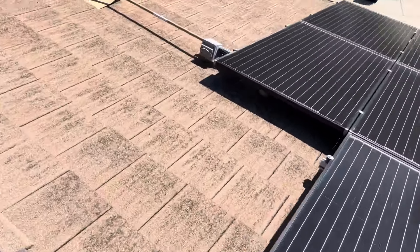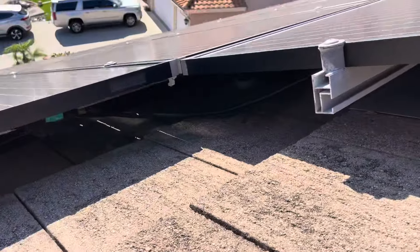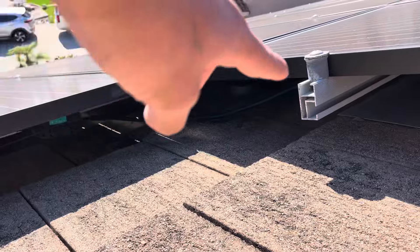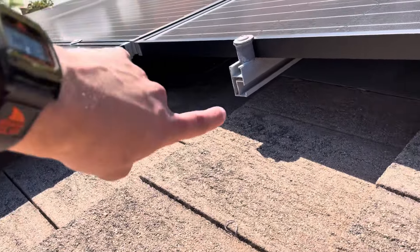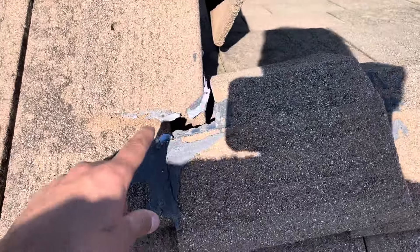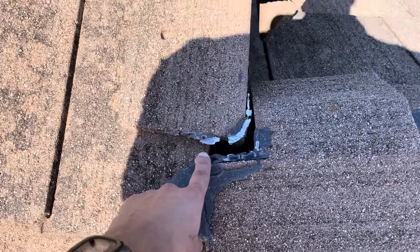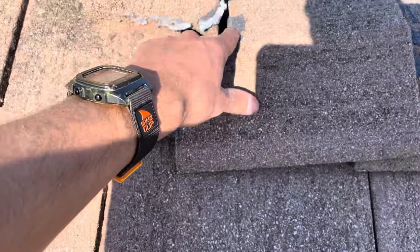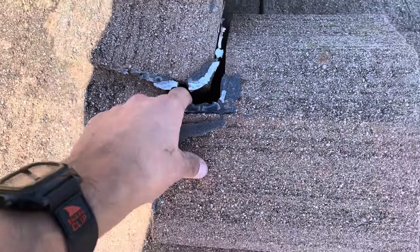However, I did notice a wire sticking out right there. We don't want to see wires sticking down — we could actually put that back up underneath. And then there's another exposed area to the rain: we see this cracked ridge cap. You can see mastic has been applied right here, but that rain is going straight down into the wood decking.